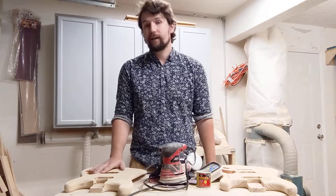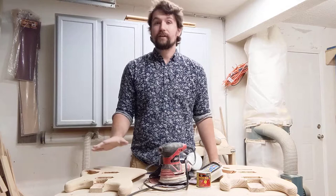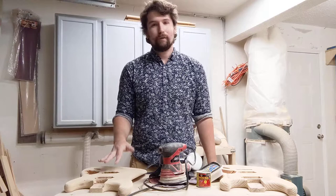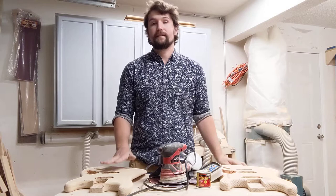After that, when you're happy with how it feels and looks, step it up to 320 grit sandpaper — front and back with a power or hand sander, and the edges with hand sandpaper. After that, the last step is optional, but I like to do one more sanding at 400 grit. The difference between 320 and 400 grit is debatable, especially on wood, but I like to go the extra step and make sure it's as smooth as possible before the finishing process. Do the whole thing in 400 grit, and then let it sit.